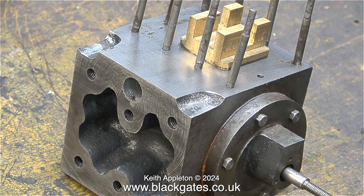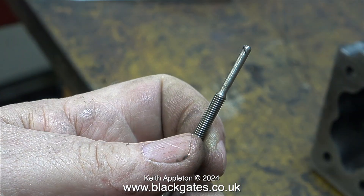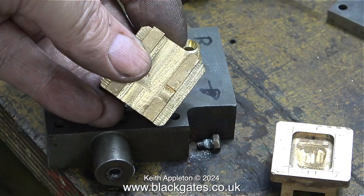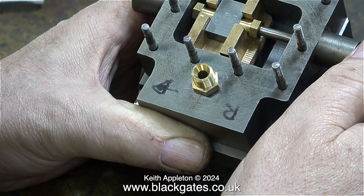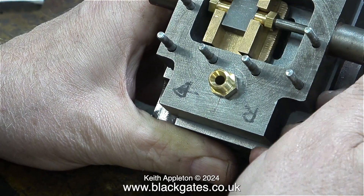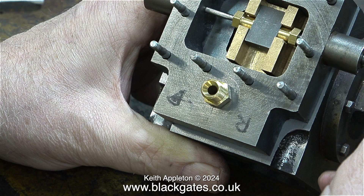Also, the shape of the valve is not so good — it's just chopped off on the corners. The corners of the valve need to be rounded to match the shape of the steam chest. To start with, I'm shortening the valve spindle, only by a small amount, just to see if it makes a difference. This method is no good at all — it's really labour-intensive just to remove the valve spindle. At this stage, the original slide valves do need some lapping. They've been clumsily machined, and as you can see in this image, there are some marks on the surface that slides over the port. Once I put the valve back in place and refitted the nuts to the valve spindle, it was better, but still not good. A lot of the jobs I do are not scientific, and I do it by feel, and this does not feel right. Looking at this image and listening to how the valve hits the steam chest on the inside, it's clearly not right. Do I have to make new valves? I don't know, but I'll do it one step at a time.